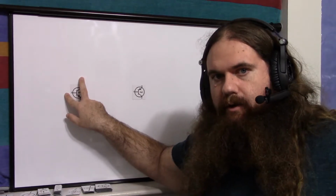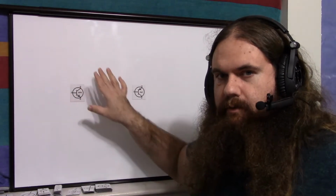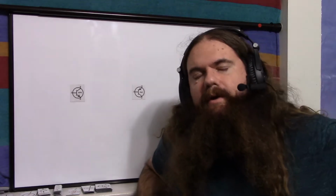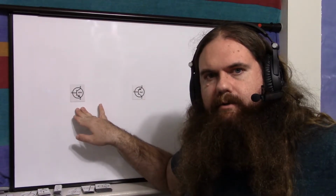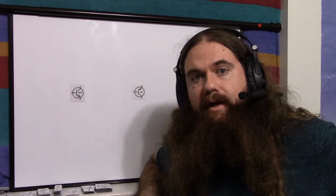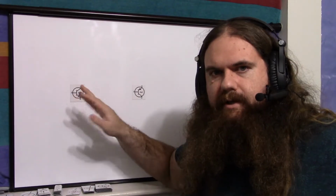So if you connect only across the collector and base or emitter and base, and don't do all three pins, just those two, these two or these two, then it behaves just as a diode. And some people use it that way. There's actually certain cases where you need the function of a diode, but the physical properties of a particular transistor work better for that particular device. It's kind of interesting that way, that a transistor can make a better diode than a diode. But in any case, connect two pins there or two pins there and you get a diode.